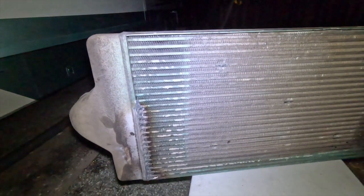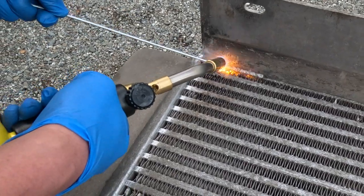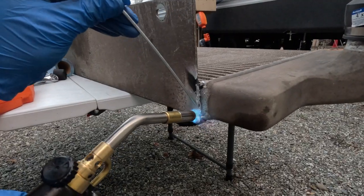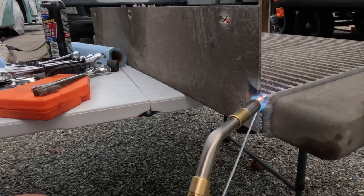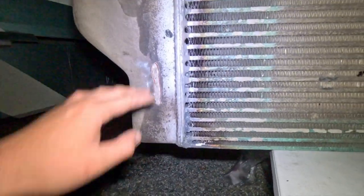I tried to use aluminum brazing on these tubes after they told me they couldn't fix it. I tried using a torch to heat it up and then melt the brazing bar to connect the broken part. The second step was to fix the leaks in between the tubes. That aluminum brazing is just so difficult — the margin between melting it and reaching enough temperature is very small. I was either not reaching the temperature and the brazing didn't stick, or I melted the part. I actually melted this tube. Then I went to the welder and he helped me patch it and fixed most of it.